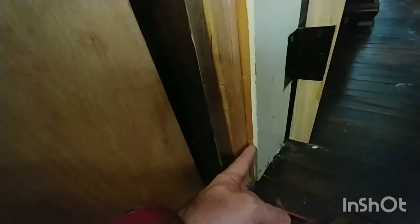And so I'm tight to the framing here, and I actually had to put a fresh end on the sole plate because it was a little proud of the last stud, and that little bit was holding us off the stud a little bit, and it was squeezing the opening a tiny bit at the bottom more than at the top, you know, because what you're looking for is to smash the fuck out of your fingers. That's what you don't want.